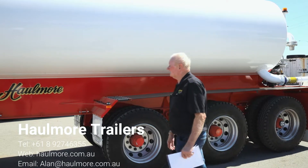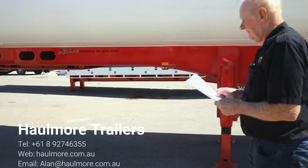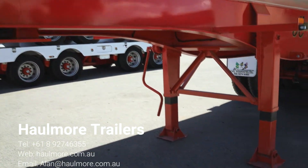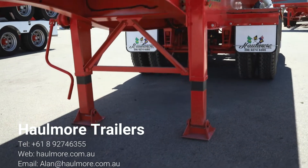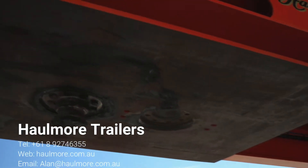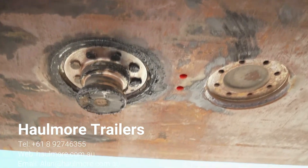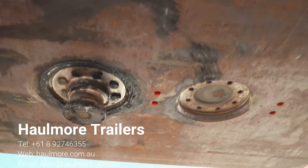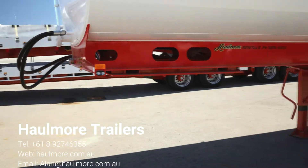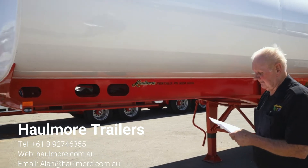Two speed landing legs. The Australian pumping gear I've mentioned is a bit more expensive but it lasts for a long period of time. The king pin is two positions — one position for a bogey drive prime mover and a tandem dolly, and the second position underneath for a tri-axle dolly, thereby achieving correct weight distribution. The skid plate is also oscillating so it's stress relief — it doesn't exert any stresses on the tank shell itself.